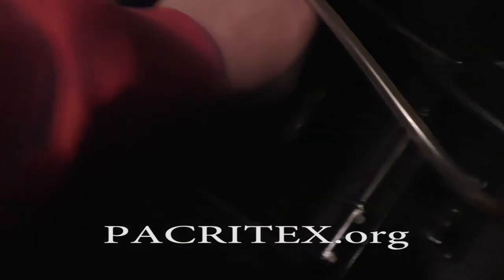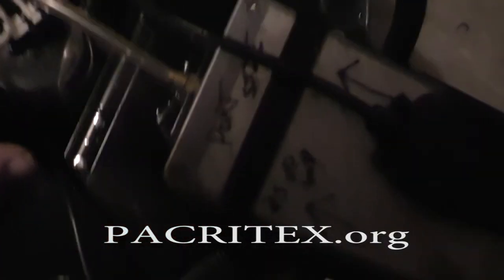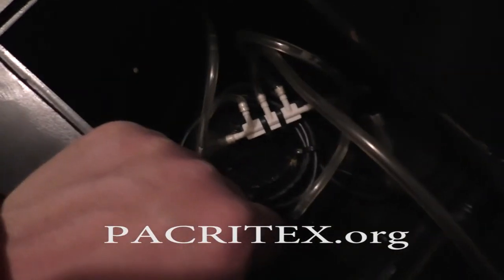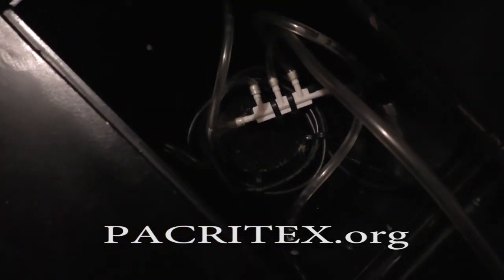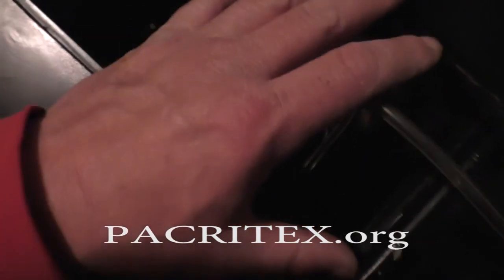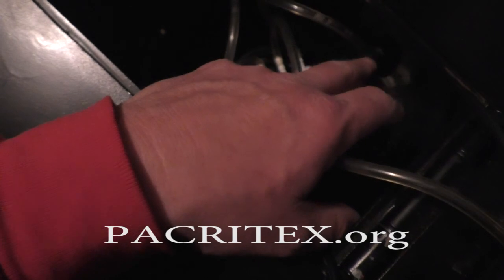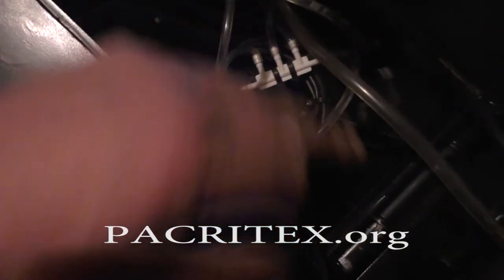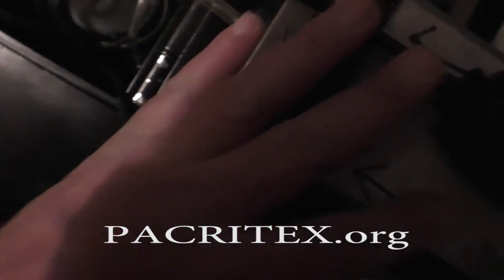What I found was that some of my tubing for the pressure switch for the in-par actually became dislodged or moved. Now, the way it's set up, you have four inputs and one output. Each pressure port is an input on the outside of the probe, and then we have one output coming to the in-par.